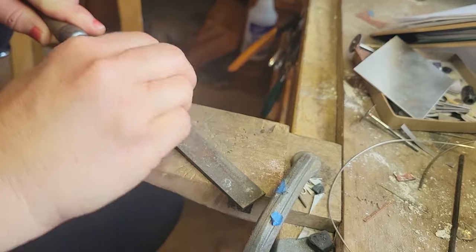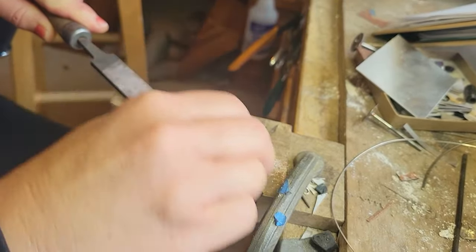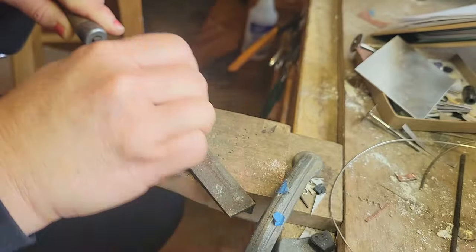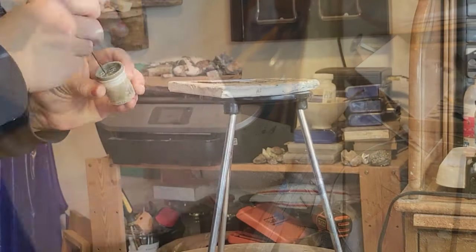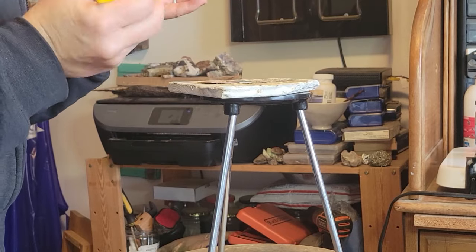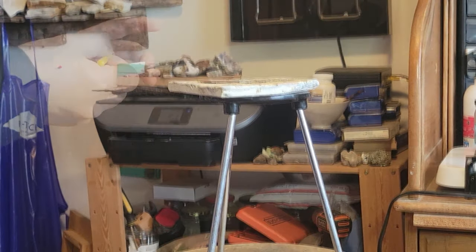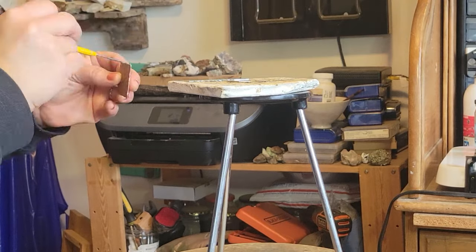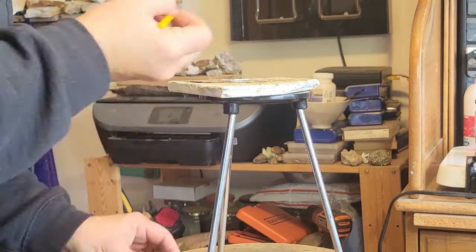Yeah, but seriously, we're evening out these pieces so we can meld them into one piece of amalgamated sheet metal, a horse of at least two different colors, if you will, sterling and copper patchwork. For this chore, I love solder paste, so I'm slathering it on the puzzle pieces, preparing it for the torch.